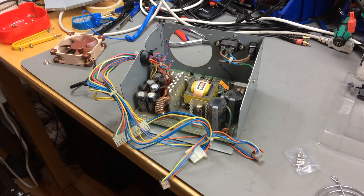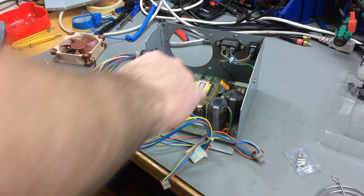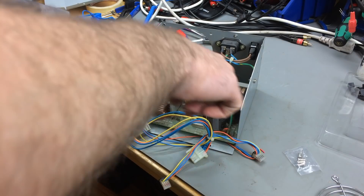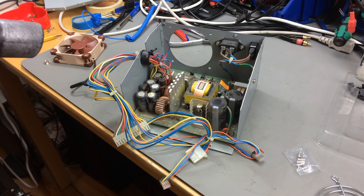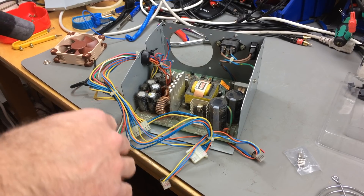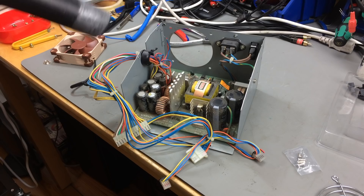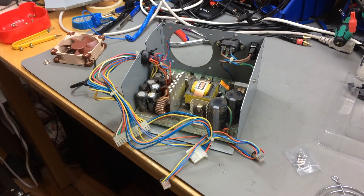While I'm at it — it's not very necessary in this particular case, but these large capacitors store around 200 volts DC, which you don't want anywhere near your body. Be very careful with switching power supplies because they have high-voltage capacitors in there. That's why there are all these warning labels on them. These things might actually kill you if you touch the wrong part. So stay away from the capacitors when working on these.